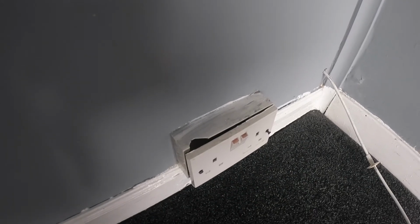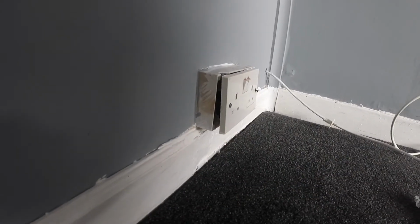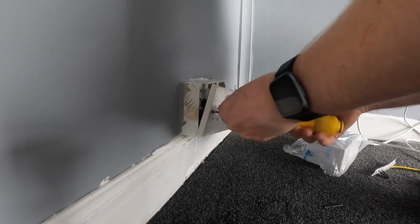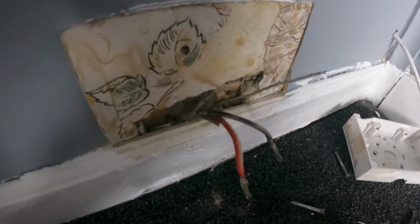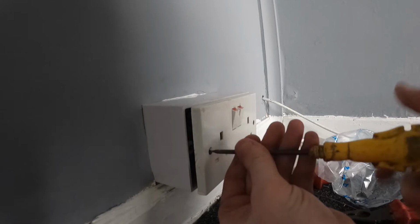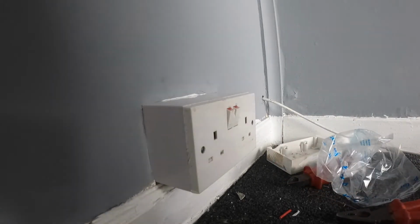So this is the next thing on the remedial work list. Obviously a crack in that patress, so that needs swapped out. Okay, that's the length we've got to play with there, not sleeved. That was a nice easy change. Just swap that over just like for like. Again, this is all estate agent work, so obviously they're wanting costs at a bare minimum, which is why they've not wanted a new double socket put on that.